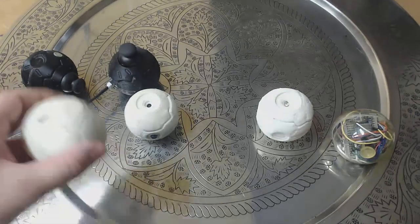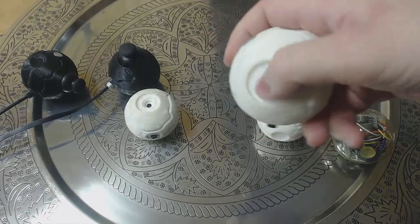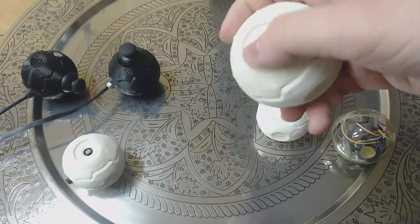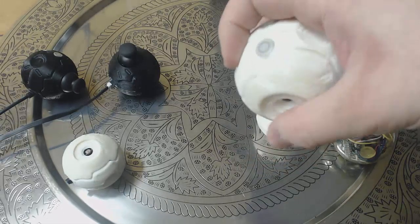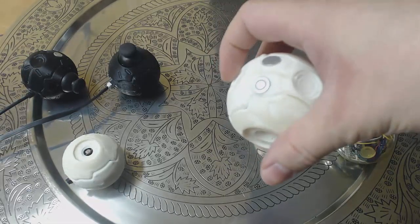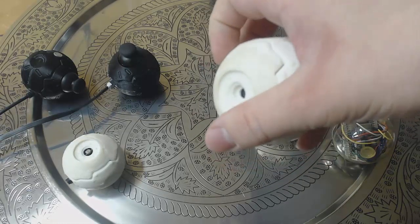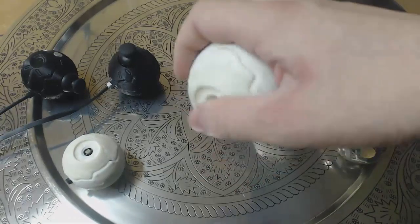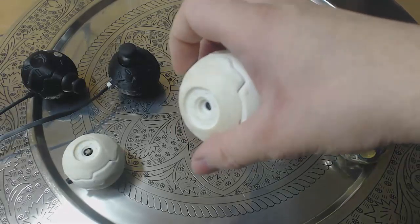In the third prototype, the RGB LED and photo resistor were excluded, and two push buttons were added for easier use, even though it has the same tap capabilities. For most users, the tap capabilities would be hard to use for standard situations — for instance, if we use it as a computer mouse, tapping like this wouldn't be so convenient.